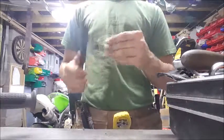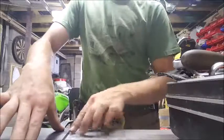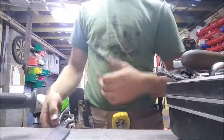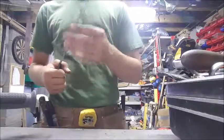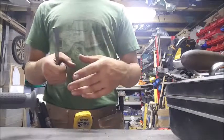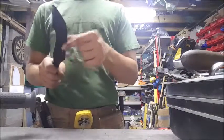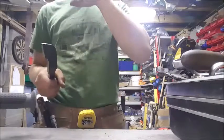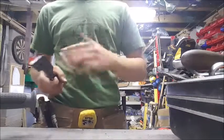So instead of doing my old trick where I put it on something and then take a drill bit and run it up there, because it's not an equal thickness or a uniform thickness, it could be like 5.3 mil or something like that in places. So instead of doing that, I'll measure the width at equal places with the caliper and just run up the center after coloring it in. So that's the plan I'm going for anyway. We'll see how it works, and after that we'll grind the bevels in.